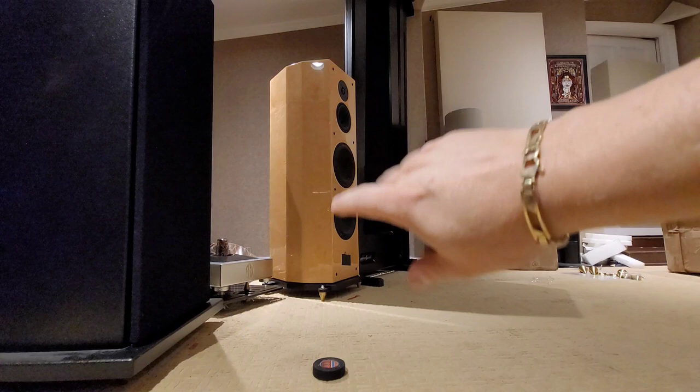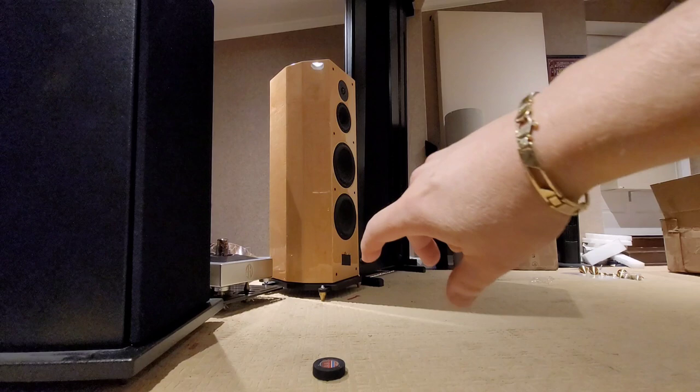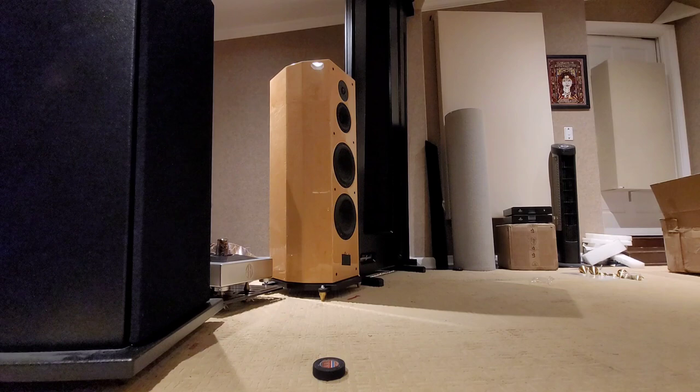Inside any speaker, you've got, inside in the floor there at the back, something like that, you've got a filter network, which is a crossover, and it's a passive because you're sending it all the energy and all the frequency, and then it's going to bleed off some to heat, and it's going to put some over here, and the rest is going to go over to here, and then what's left is going to go to there, that kind of thing. So it's a little bit lossy. You lose energy, you know, in that process,